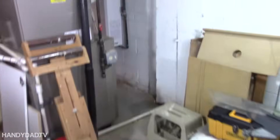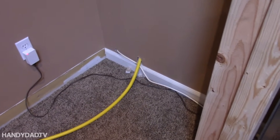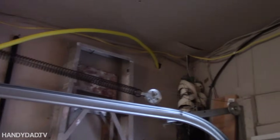What I've done is run CSST from the fireplace through my garage. This is the gas line — it's just loosely put in there for now. I ran it so that it goes into the hole in the wall there. There are going to be cabinets here, so this will be covered — it won't be exposed like this, and those holes in the wall will be covered as well. It runs up the wall, and I snaked it so it comes out the top. I'm going to run it across the ceiling and down behind those storage units, and I drilled a hole that goes down into the shop.